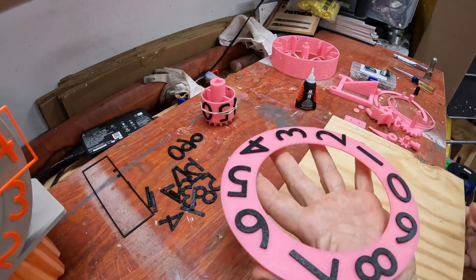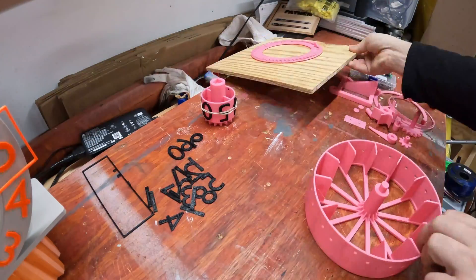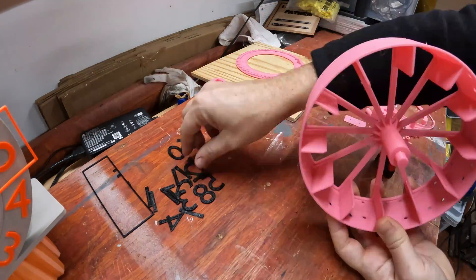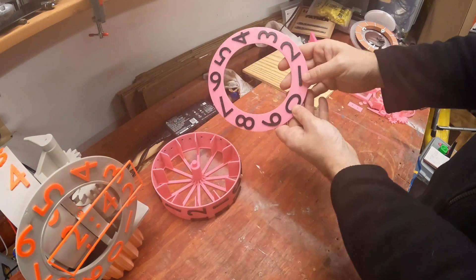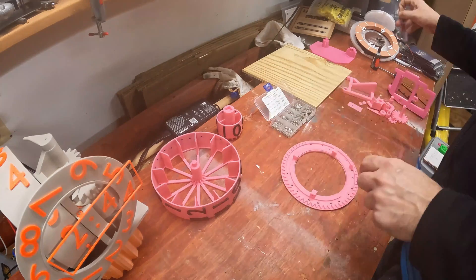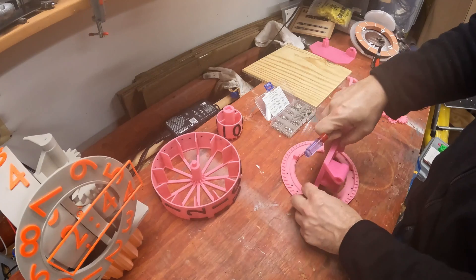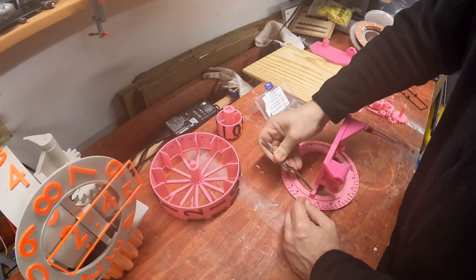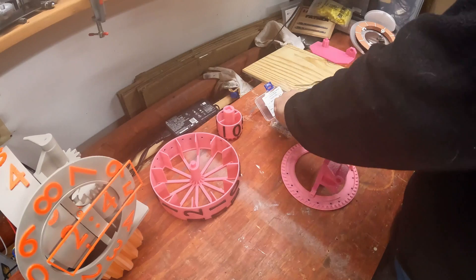For this initial build, the controller is just counting ticks of its internal oscillator and then outputting minutes to the stepper motor. I'd like to upgrade the system to get time off the internet and know what time it is on the clock as well, but both of those things require a little more work. In terms of other parts, the build uses two millimeter tapping screws, a 28BYJ-48 stepper motor, a ULN2003 driver board — which is just an array of Darlington transistors — and basically any microcontroller.